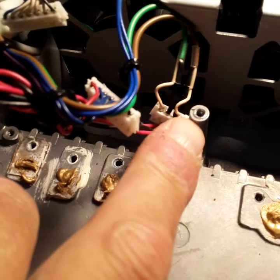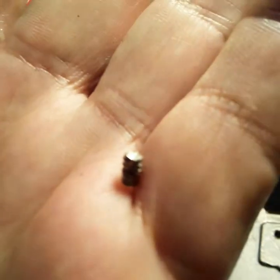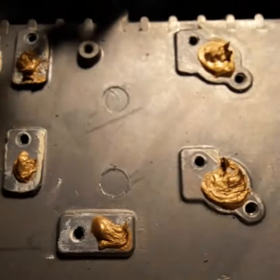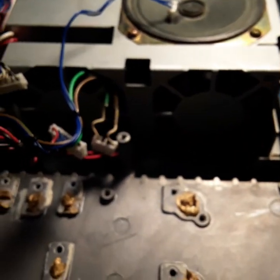Alright, there was another problem I noticed. See this post right here that holds the board in? It had a broken stud in there. I had to take it out with a pair of vise grips — it's from a screw, the head busted off and they left it in there. But we got it out. So we're doing everything we can to get this thing cool again. It's a workhorse radio, and when it gets hot, it gets hot.